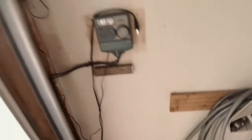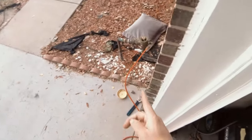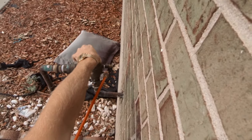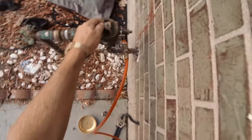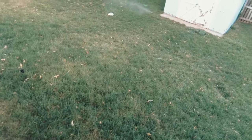Basically, manually control your sprinkler zones. My sprinklers are on right now but there's no water so they're not popping up. This valve is closed — once I open it, it'll put air into the system. I actually have to hold up on this little valve in there. I open it up and there's station three blowing all the water out. That's at 80 psi.